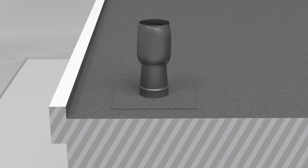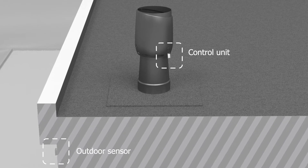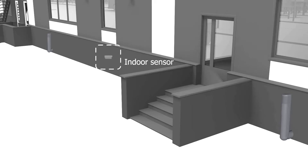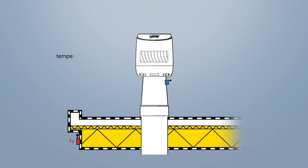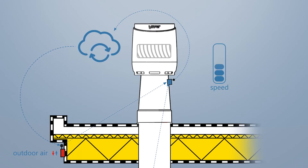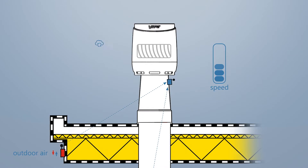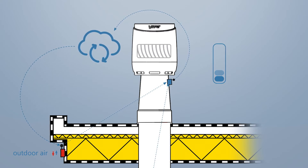The solution consists of Vilpe's roof fan with an EC motor, along with a control unit, mobile base station, and two or more sensors. One sensor is placed to measure the temperature and relative humidity of the outdoor air, and the other is placed inside the crawlspace. The algorithm compares and calculates absolute humidity levels in structures to outdoor air absolute humidity, and adjusts the Vilpe Eco roof fan to the optimum fan level based on the ventilation demand. For example, when the humidity level of the air used for ventilation rises too high in rainy weather, the airflow is reduced.